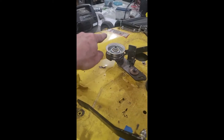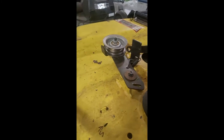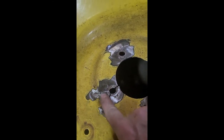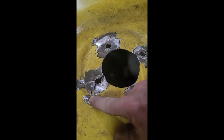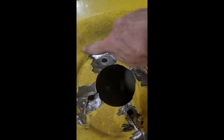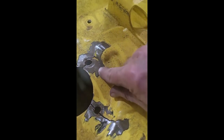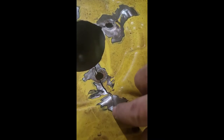There's a crack on a front wheel, again, where he hit something, and a bracket like this cracked. So then I get to the other hole, and here's this other one. Okay, so you can see this crack here, that is about 2 inches, 2 1/4, all the way to this one. That's probably a 3-inch crack through the deck. There's multiple cracks here, here, here, over here, this one, all the way up to here, and a crack around where it broke there. This one is almost a 4-inch crack all the way up through.